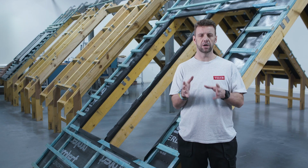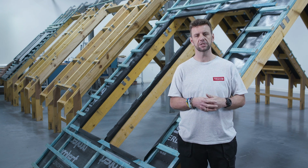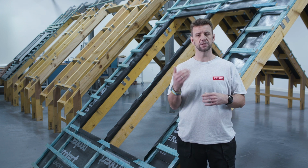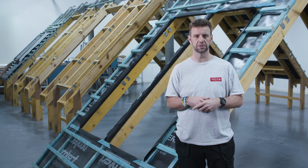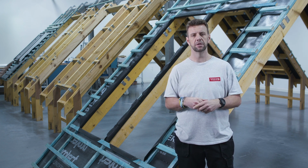We're going to fit these with a 100mm frame gap, which is a more standardized version of the combi flashings, but we can offer a range of flashings for any gap from 60 to 400mm, which is handy to know if you have to double or even treble up your timbers. So you can still ensure that you leave sufficient space either side of the timber for adequate insulation. That's why for today we're just going to be using a single timber, which would still provide us with ample space for our BDX insulation collar and the BFX underfelt collar.